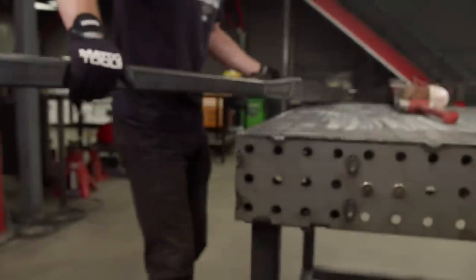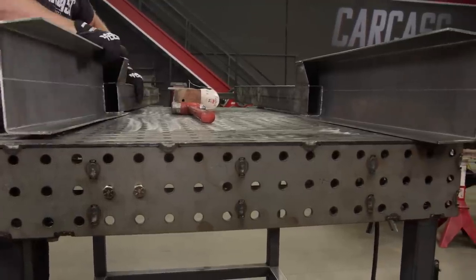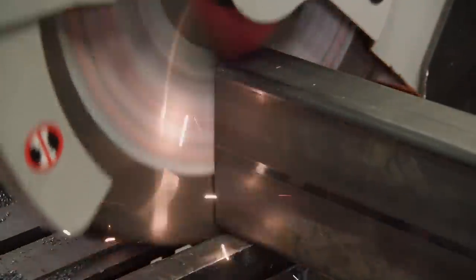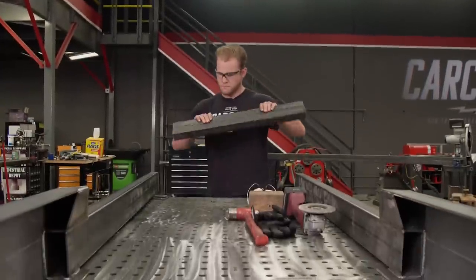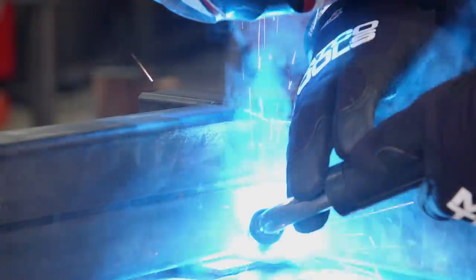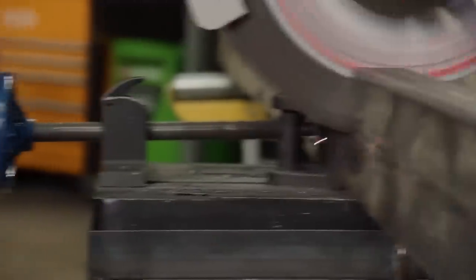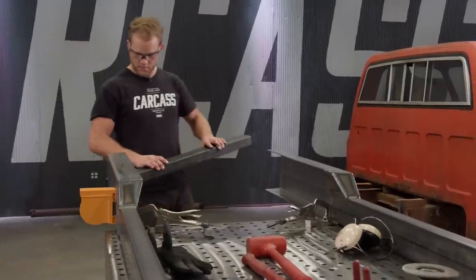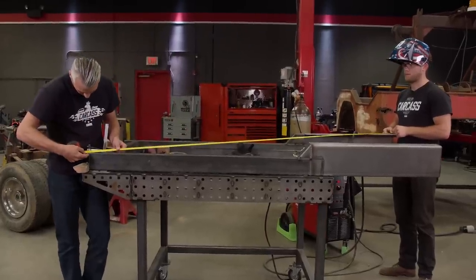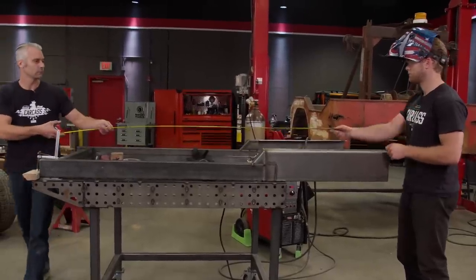With our gussets getting their final welds, we'll need to line up our new frame rails so we can build out our cross members. These are sized based on the original frame width, minus the thickness of the materials we're working with. For our first cross member, we're using the same 4x2 tubing we've been using throughout the process. We're adding a second one inside the C-channel, so this will require a different length of tubing. Before we tack this cross member in place, we need to check our measurements to ensure everything is square: 91 and a half — same on both sides. Roll it in.